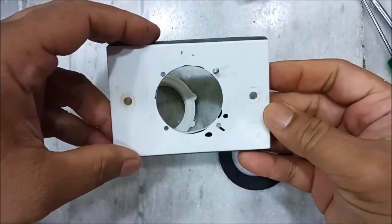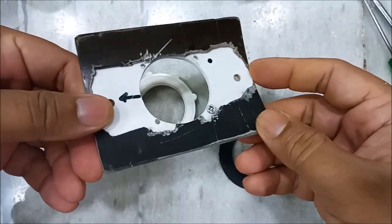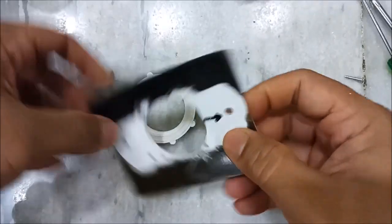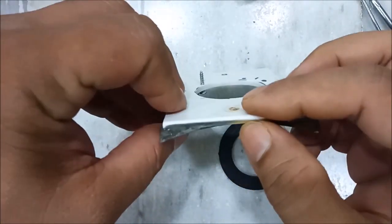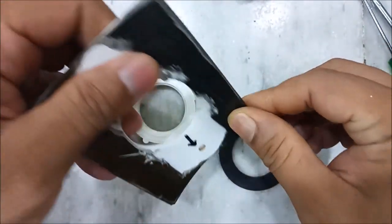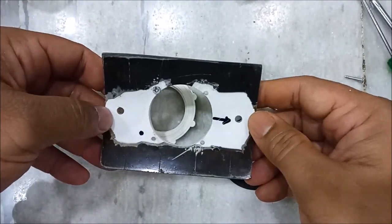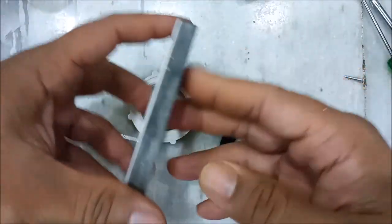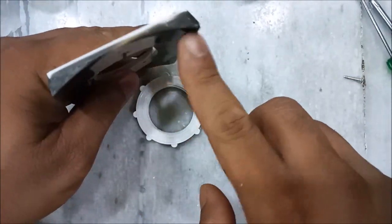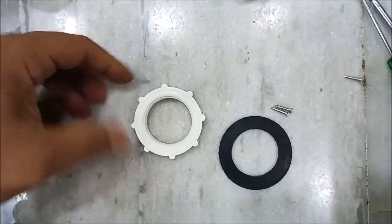This is the focuser plate I have made. I made a round cut in this focuser plate and this is the back side of the focuser - it's basically a piece of flat PVC sheet, around 3mm. What you see here is basically the hard epoxy which is used; the plumbers use it to fix leaks - in India we call it M-seal. What I did basically is I placed it on the pipe and filled that M-seal at the corner so I got a nice clean curve, so this entire plate will go matching with the curve of the tube.